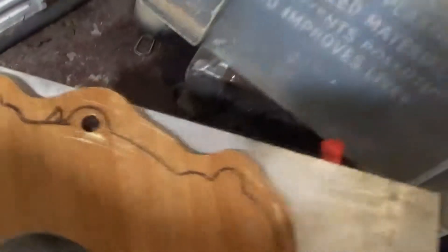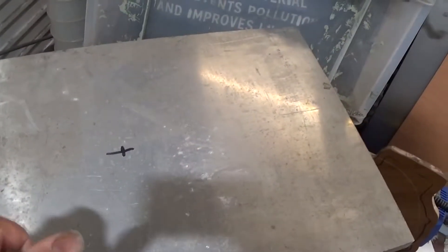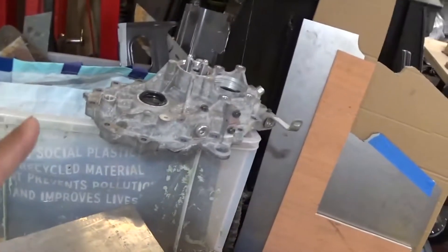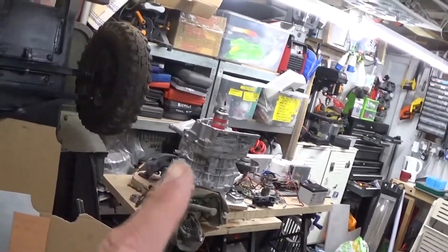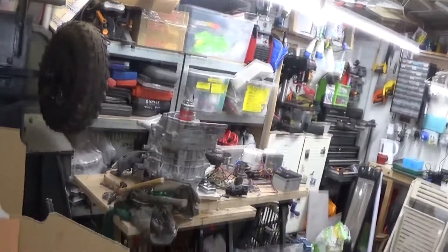So there is my aluminium plate that I've got at bargain price — it's 20mm thick, pretty much the same as the MDF I've got down there. That's a close fit — I have left overhang on the wood but it's pretty much edge to edge on there. I'm going to attempt to drill with a hole saw into the middle of that. I might put some oil on it as cutting and cooling fluid. I'm going to offer the gearbox on top of it to get an orientation of the top and bottom, because I need to size up the orientation — otherwise the motor will be off. If I want to pick up any engine mounts for the motor in the engine bay, then ideally if it's sitting square in the engine upright that's a bonus.